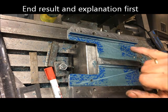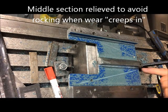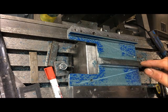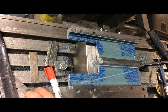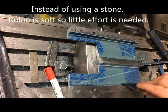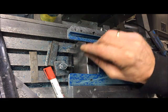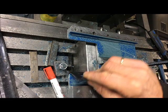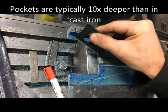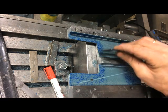This is the final product. I've applied a little bit of blue on it to see the difference, so that it's not touching here and there's really a relief. As you can see the coverage is okay, and with this tool you can see how it's blunting off the high spots. I think that is the better way of using it instead of scraping like that.